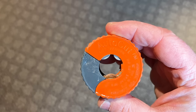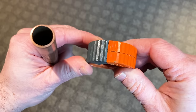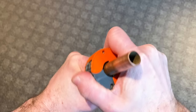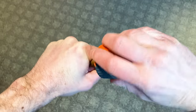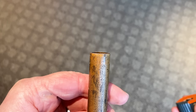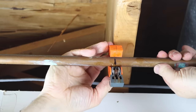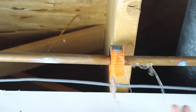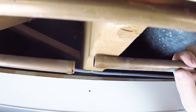The first tool we're going to use is the auto cut tool. It's a tiny little tool that clamps on the copper pipe and also fits in tight spots. There's a directional arrow on it — you simply turn the auto cut tool in the direction of that arrow and within a few seconds you'll have a perfectly square cut on your copper pipe, which is really important for SharkBite fittings and also for soldering. We align the cutting wheel over top of our Sharpie mark where our pinhole leak was located, cut the pipe, and we have about one inch of separation between the two pipes, which is good for our SharkBite coupling.